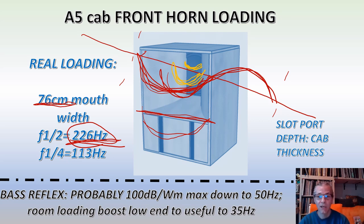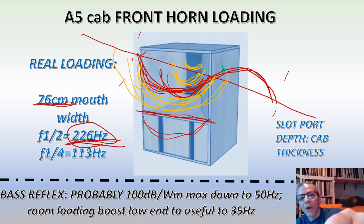And it's rather closer to a kilohertz, maybe 1.2, 1.5 kilohertz tops. However, if we want to go lower in frequency and higher, or longer, in wavelength, then if you think about this long wave, there is no cabinet behind it anymore. So a wave with that wavelength, let's use a green color, starts to wrap around the cabinet, you see?